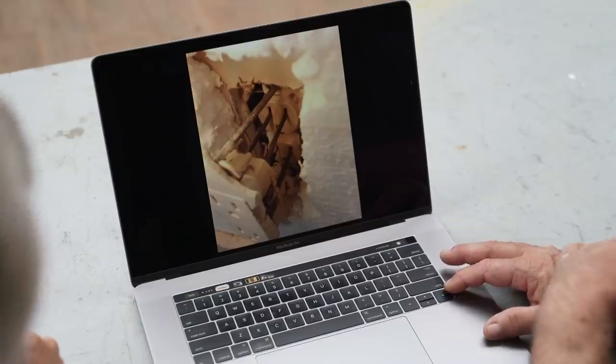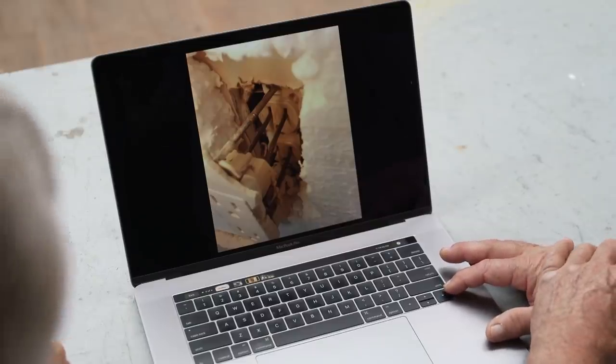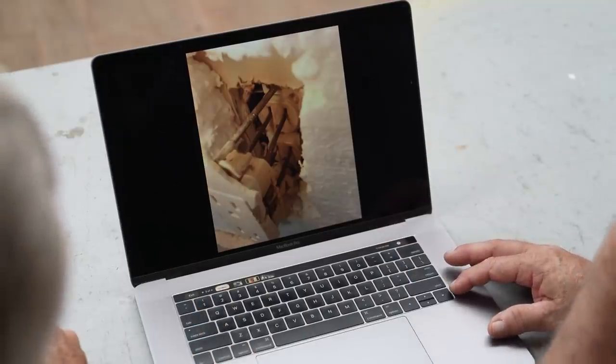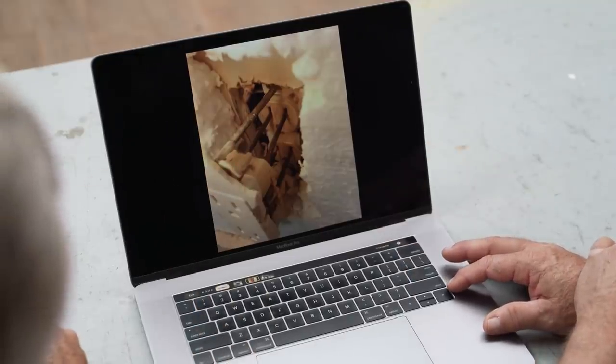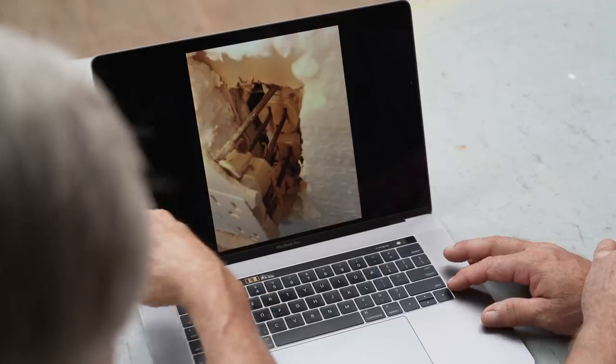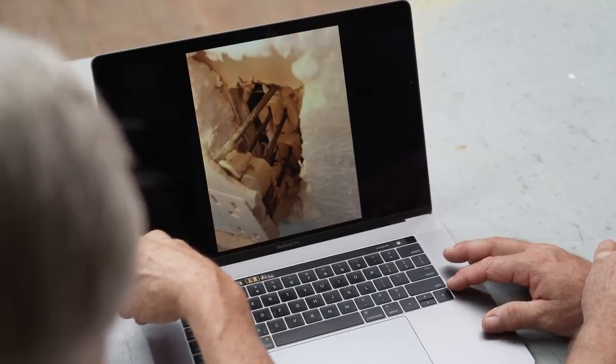Oh my gosh, what is that? So this was someone who added something to the wall — it looks like insulation of some kind and then another finish. Normally you can just extend that electrical box and bring the device forward; it's simple enough. They went through a lot of work to really do it wrong and unsafe. It looks like wire where they stripped the end and stuck them in there like prongs of a cord cap. That's more work than moving the plug out, and dangerous. Somebody call the insurance company — they've got a claim coming their way.